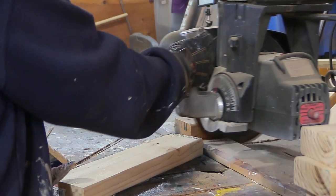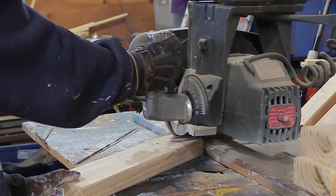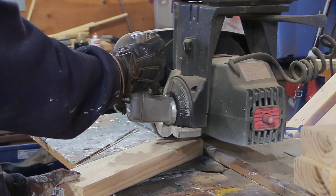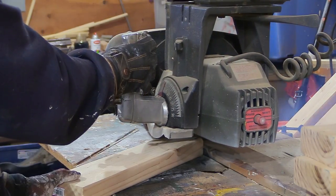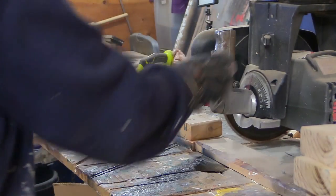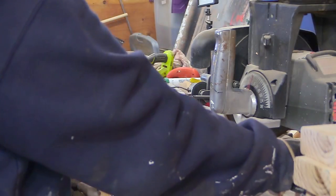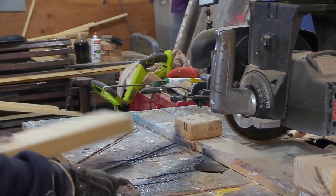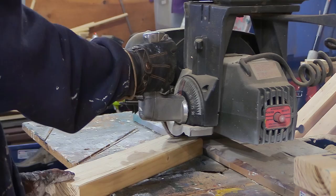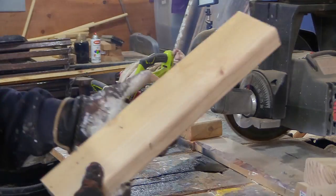I have a template for cutting the corners off the feet. So what I'm doing right here is cutting at about a 45-degree angle — maybe 50 degrees — taking the top corner off of the 2x4 so that it makes more of a beveled edge, so it's not just a straight line. I do this on every one of the 16-inch pieces of 2x4 that I've cut out, because these are going to be my feet and I want them to look similar to the feet that are already on the standard.